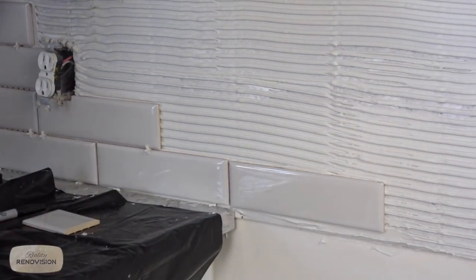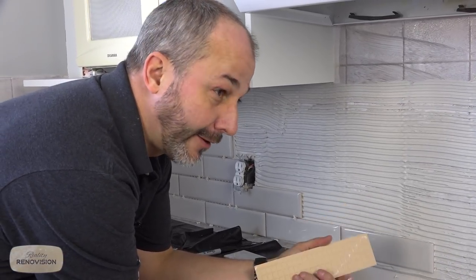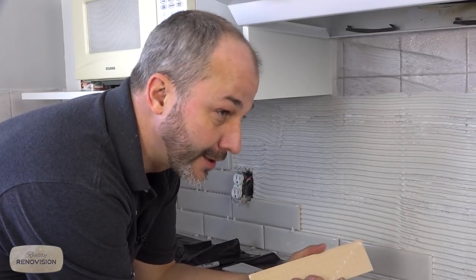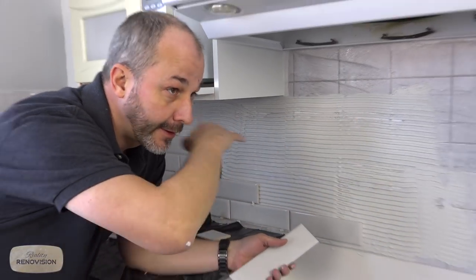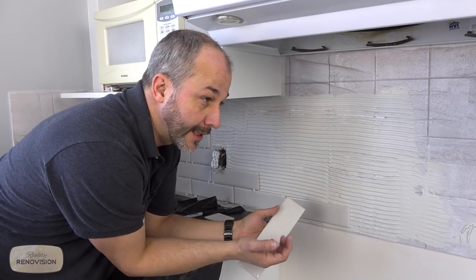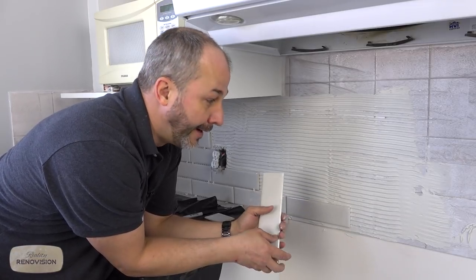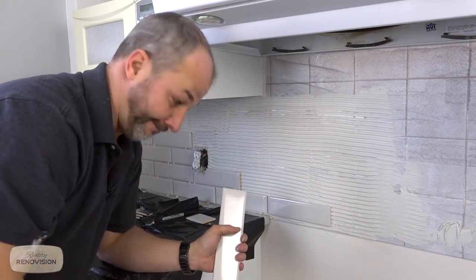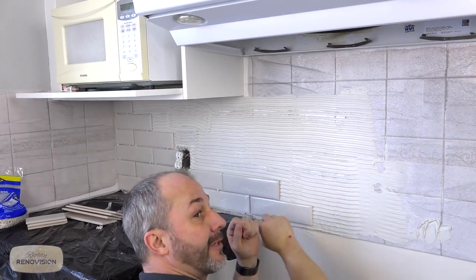The benefit of tiling over tile is really obvious. Generally speaking, if you remove a backsplash, you have to take the tile off the drywall surface and the drywall gets destroyed — it's really difficult to remove just the tile. Most guys will remove and cut out all the stone and drywall, replace all the drywall, and it creates a whole lot of work — almost half a day just to remove and reinstall the wallboard, then do the backsplash and grout. It becomes a whole weekend project. Doing it this way you can do it in an afternoon. That is a renovation on Saturday and fishing on Sunday.